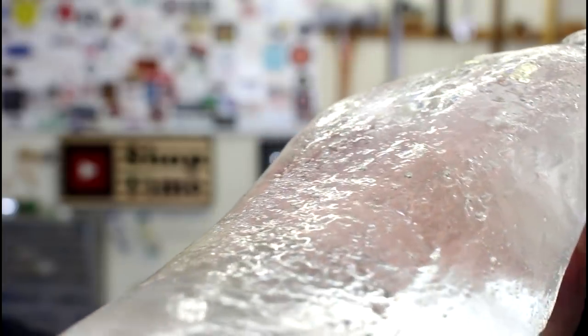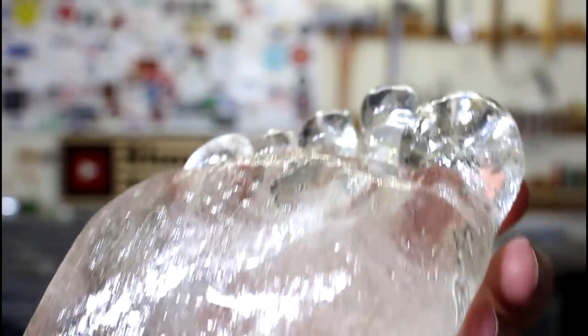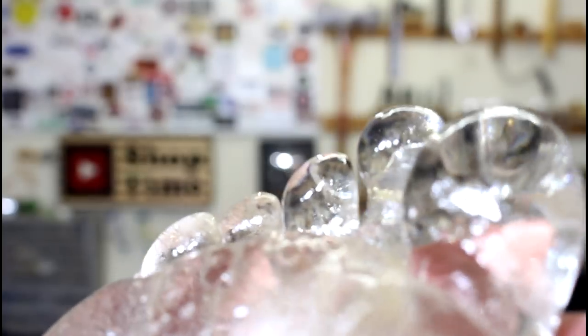At the time I saw that, I thought, well, why don't you use resin? And now I know the answer, because the two materials seem fairly incompatible. If you pour a quick-setting resin, it'll be too hot in that volume and the resin will boil itself away. But if you pour a slow-setting resin like this, then the resin is trying to cure while sitting in pools of water. This was my first attempt, back in July. I thought I wanted a clear casting and I used art resin, but the art resin actually boiled. If you look at the bottom of this foot, there's no detail at all — it's just a shape, with pock marks from it sitting in liquid. You can't see the prints on the toes.